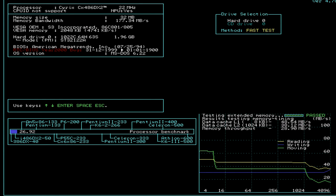So it just shows that it's definitely worth tweaking the BIOS of your computer, trying to tighten those memory timings as far as you can to get every last bit of performance out of it. I think what I'll do here is load up the likes of Duke Nukem and just leave the demo looping for a while, just to make sure that the system is stable at these faster speeds.